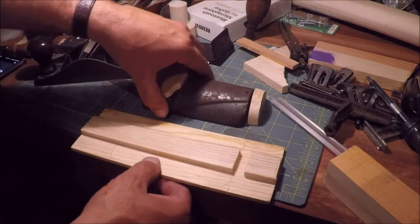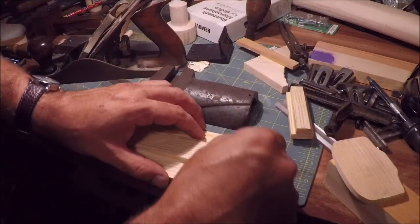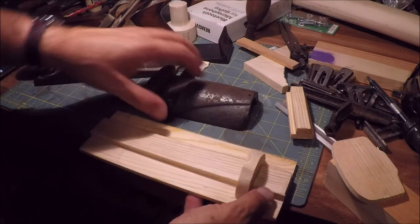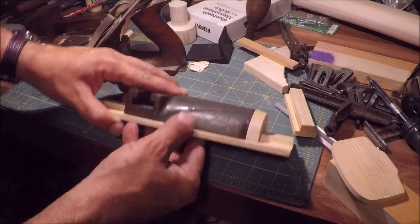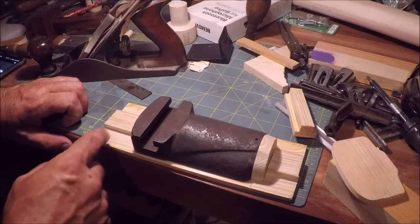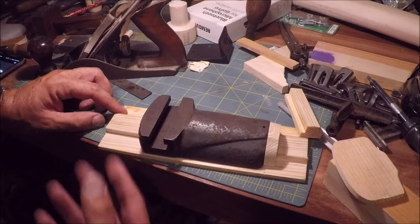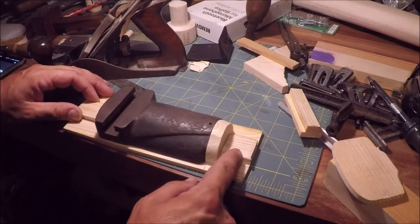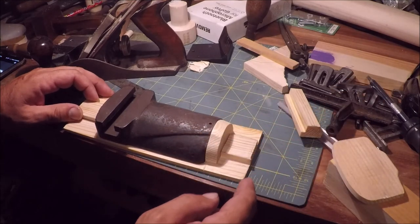This little board is going to be my machining allowance for the bottom. Pulling all this off - this piece fits in here like that. We've got about three-sixteenths of an inch there, which is plenty enough to machine back off. This piece sticking out is where the core will be able to rest - it's called a core print. You leave an imprint in the sand so your core can rest in it. On this side we need to match the shape of this cavity, and that's what the half-round section is going to be about.